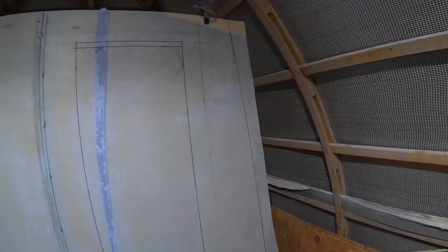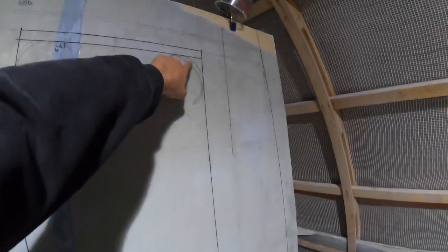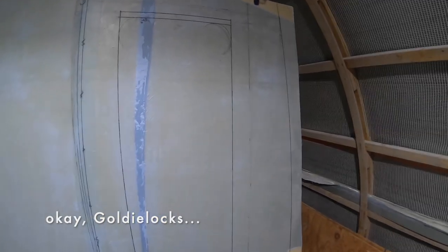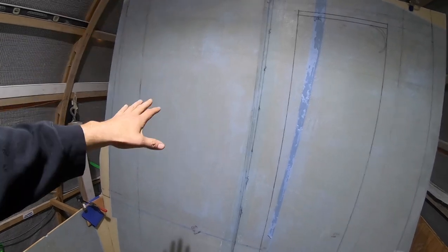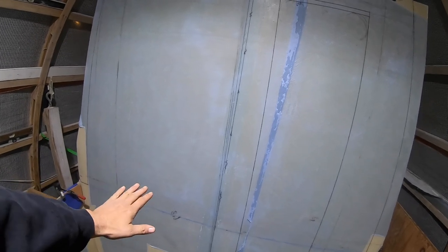It's right on the limit there. We're 20 inches wide, give or take. I've made radii in the corners — about a six-inch diameter. I tried a couple of different sizes: four, six, and eight. Eight seemed a little much, four seemed a little tight, so we're going with six. Just going by looks. Originally there were two windows in this section, but we're going to do one eventually. For now I'm holding off — I want to see where the settee ends up, because the settee will determine the lower sill of that window. All right, I'm going to start cutting.